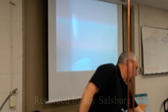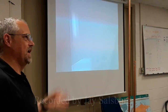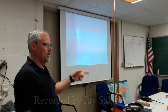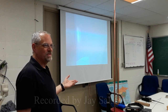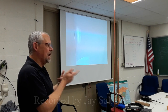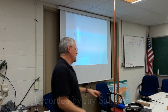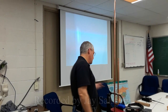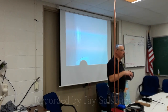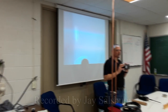Now, an interesting thing, the Yaesu 817 has a built-in SWR meter. No, it doesn't actually. It'll show me a bad signal, and I look on my meter, and it looks like 1.2. It's not quite the same thing as an SWR meter. Nevertheless, it does give you a good indicator when something drastic just happened. So basically what I'm trying to say here is, put an SWR meter in line with your antennas. Because stuff happens, and your antennas will break, and your SWR will jump, and you might not know it.